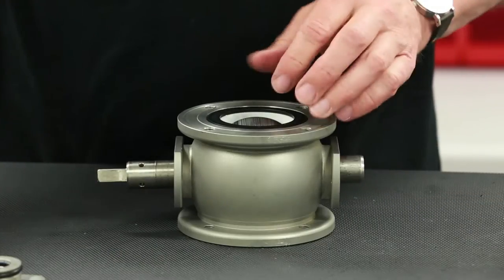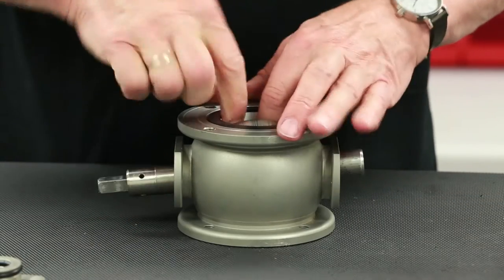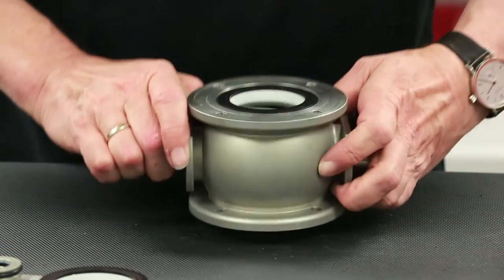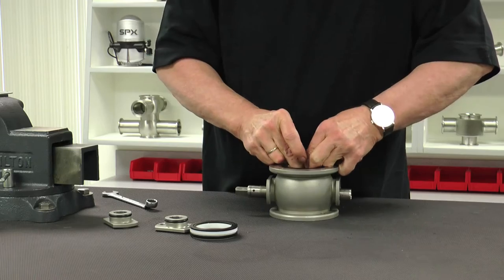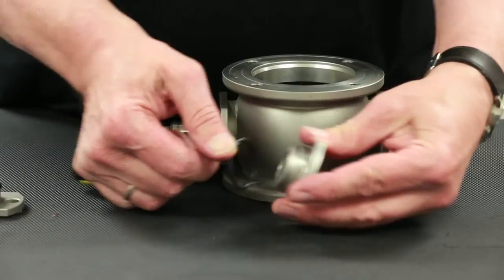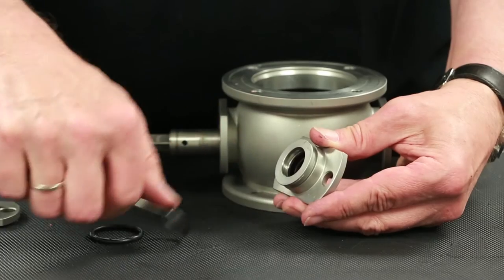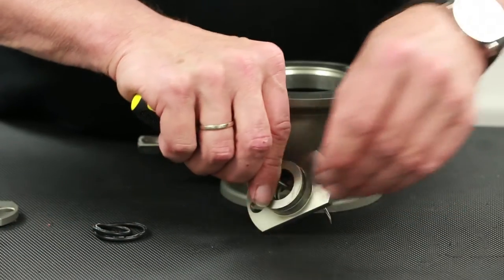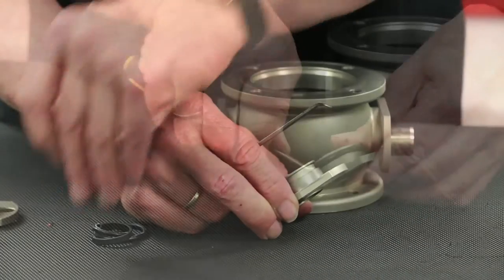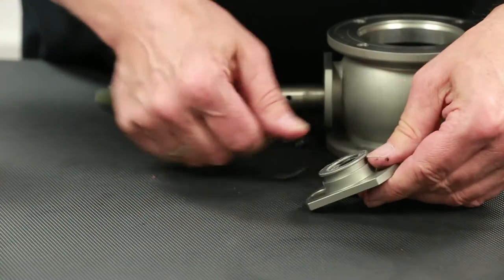To help pull out the ball seals, half open the ball by hand and grasp behind the seal. Gently remove the housing and ball seals from each side of the valve housing. With a pick, carefully remove the O-rings and guide rings from both shaft bearings. With the shaft bearings and seals removed, ensure the housing with the ball is not subject to vibrations.